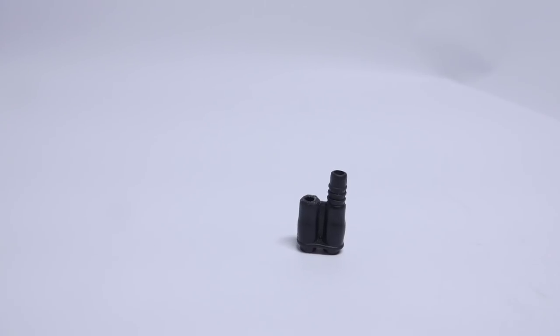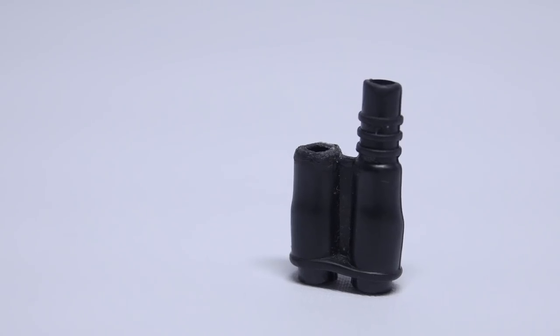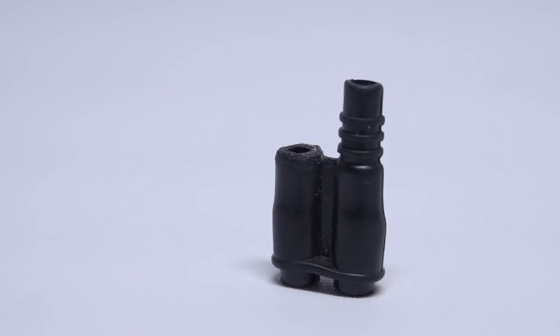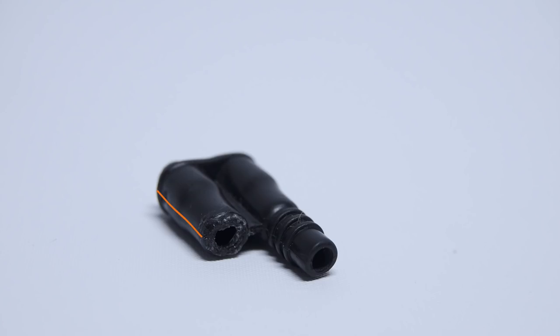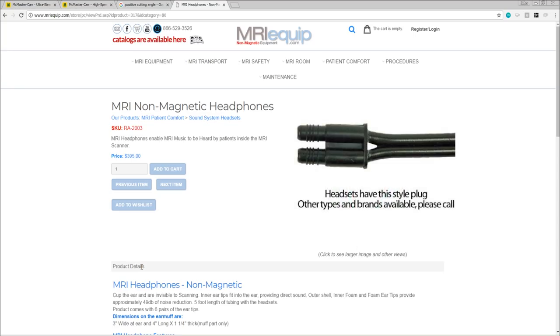Here's the broken part — a classic example of a part that probably just isn't made very well based on how it's being used. MRI technicians keep breaking this part off where it has a stress riser. You can see at the split line that this part was molded, and it's probably just too thin where the tubing grooves intersect the main body. We got a request: can we make the replacement part? Because they were buying brand new complete headphones for $395, because the company doesn't want to sell them this little replacement part that conveniently keeps breaking.